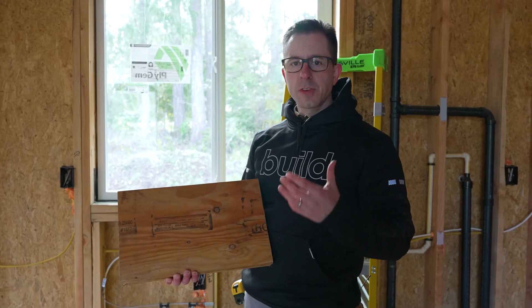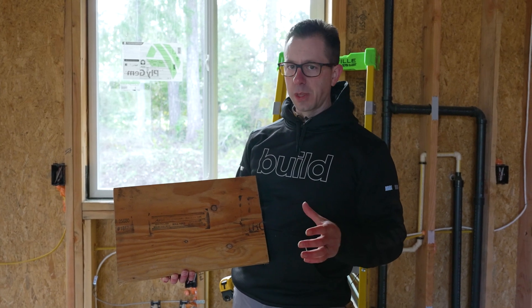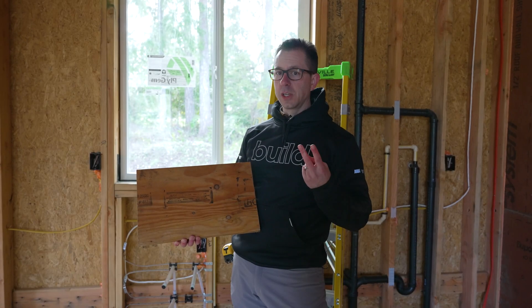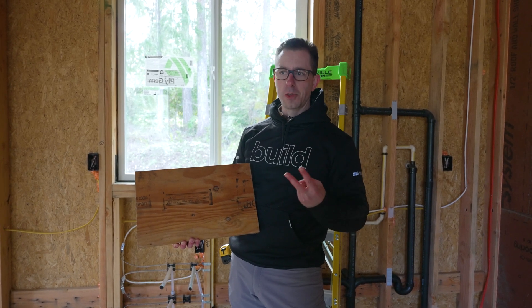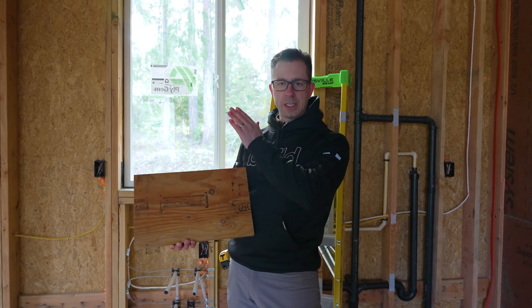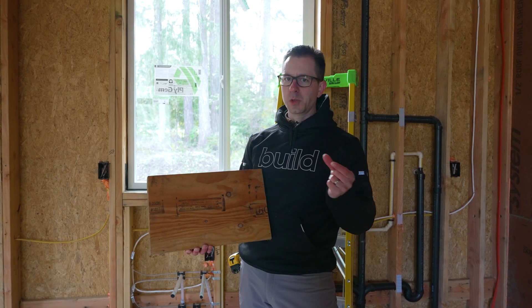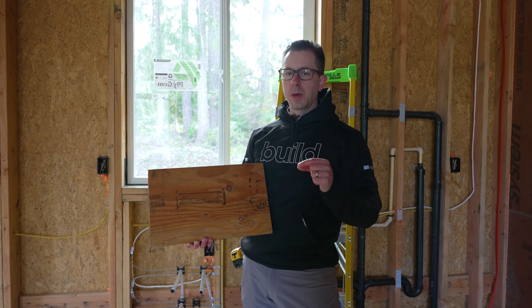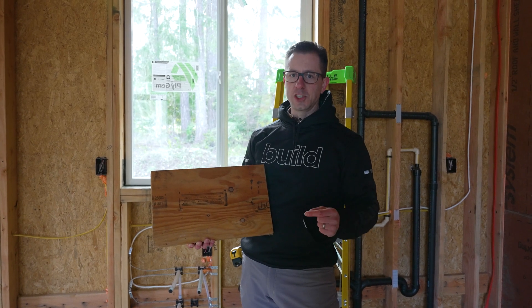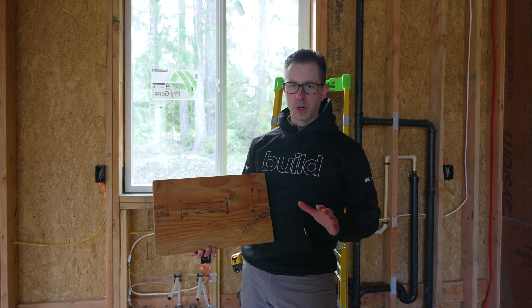Let me grab a piece of this so you can see what it looks like. We've got the header up there and there's a variety of different ways to build that out. You can use a solid sawn piece of wood and even make it full depth — but that's heavy, and it's also a good transfer mechanism for thermal heat, which is a bad thing. Another thing you could do is have the header be a little bit thinner but still solid sawn, and make up for that difference with a little bit of insulation. That's pretty much what we do in Washington State as a standard. But remember, structure trumps energy. If the load is such that we have to have something beefy, then that's what we have to do — we do not want structural failure.